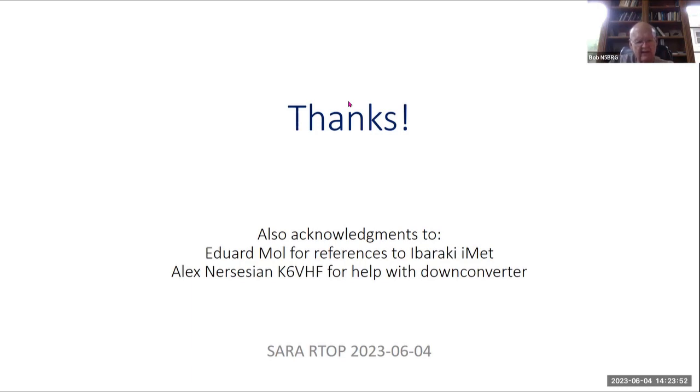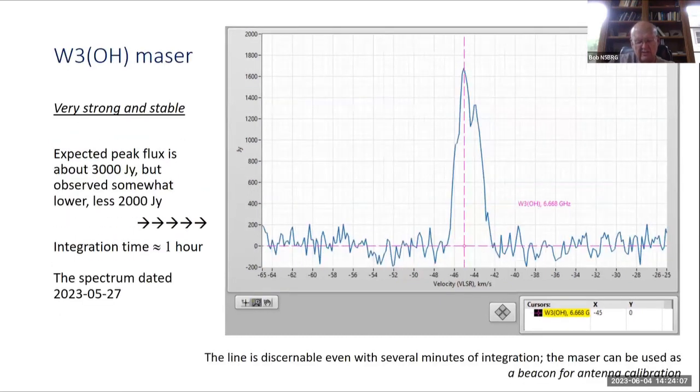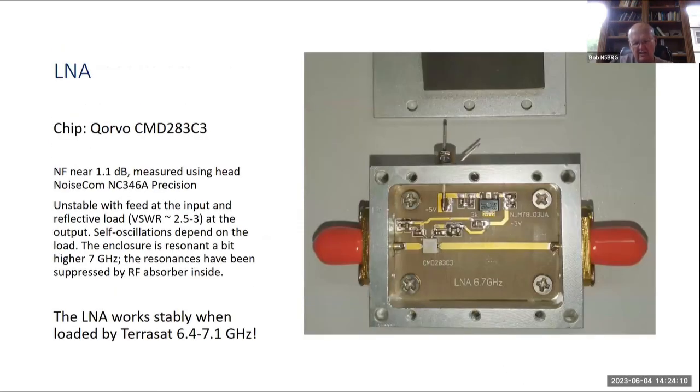I wanted to make another comment that it's interesting on your LNA that you put absorbing material on the lid, on the top cover, to cut down that internal oscillation. That's the type of material that has been discussed here a lot for making measurements with feed horns. So when you built your LNA, did you observe oscillation? And did that make you go back and add the material like that?